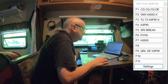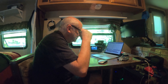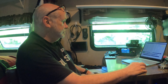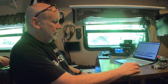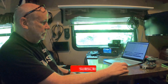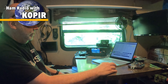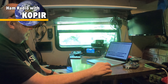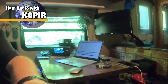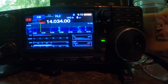John NQ4A is the one who gifted the WinKeyer to me and I really appreciate it — it's worked out great and gives me an opportunity to do videos on it. Right now I've got a USB cable from the laptop to the computer and a CI-V cable connected for rig control, with the USB cable used for CW keying. It works really well with N3FJP and I haven't had any problems with it locking up. Yesterday I was using the memory keyer on the radio, but it was a little difficult reaching over to punch the right button on the screen after sending the call sign. So today I'm going to use the software to send the macros — the CQ, the reply, and the thank you 73 — and I'll enter the call sign with my paddle.